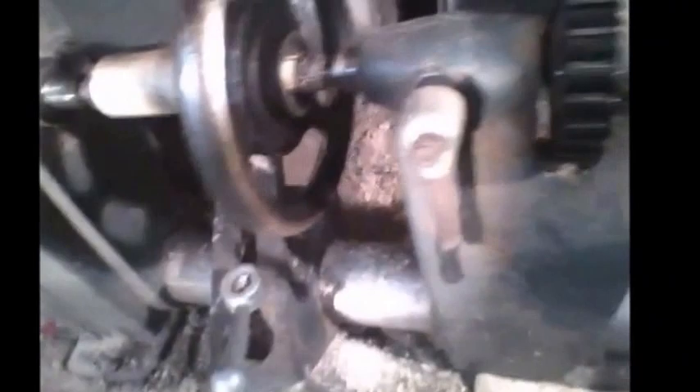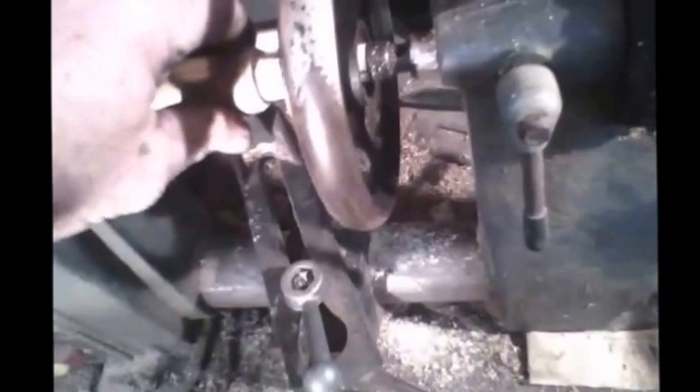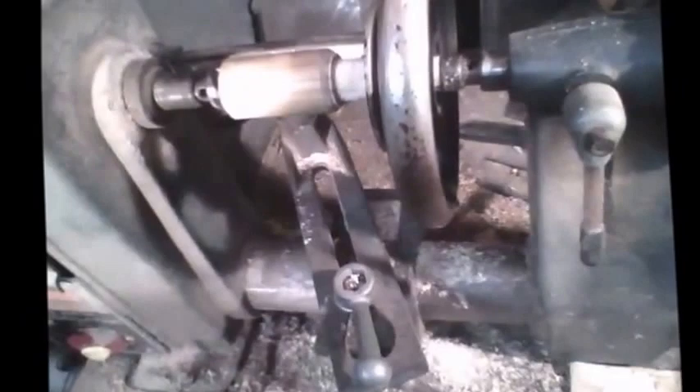I'm back. I have put the Minnesota hand wheel in the lathe. Let me see if I can get it where you can see good. This is pitted. The chrome plating — or nickel plate, I believe is what's on this — it doesn't look like it's got copper under it, so this will be a nickel plate. It's not in very good shape. There is no way to truly fix this. I'm going to go ahead and give it my best effort with the suggestion of tin foil and water.